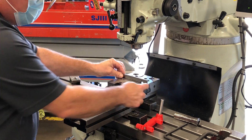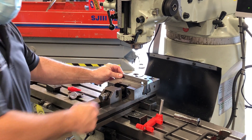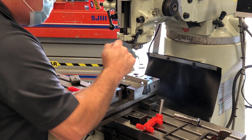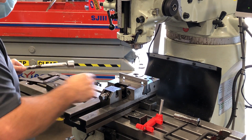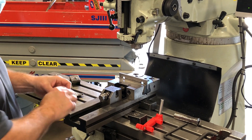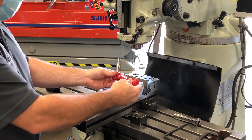The reason why we are indicating a parallel and not the actual back of the jaw is because the jaws may not be set. If they're not locked into place they will move when tightened. So therefore you tighten the parallel and that eliminates that problem. It is best practice to indicate the back of the parallel.